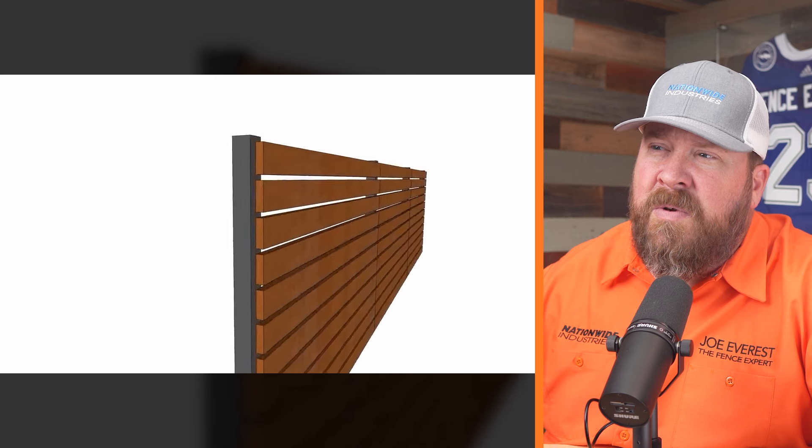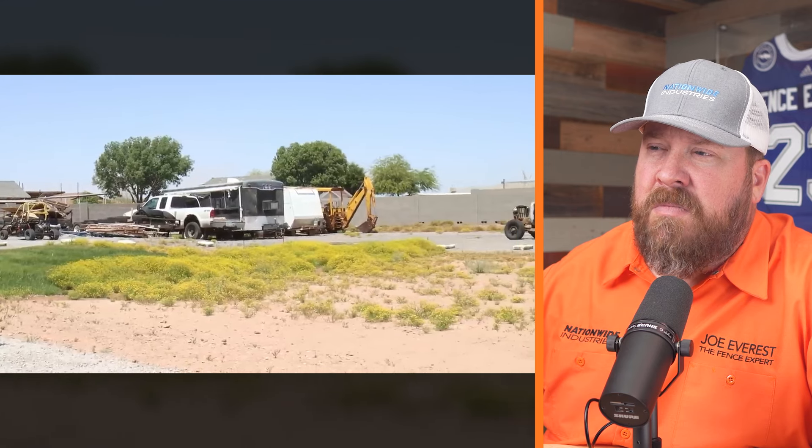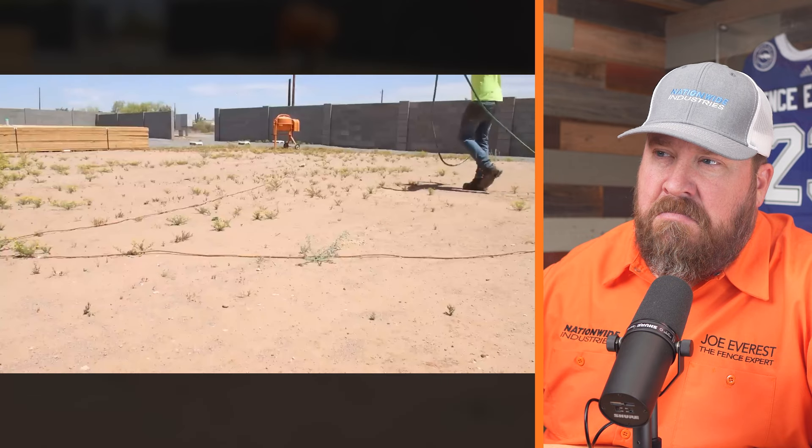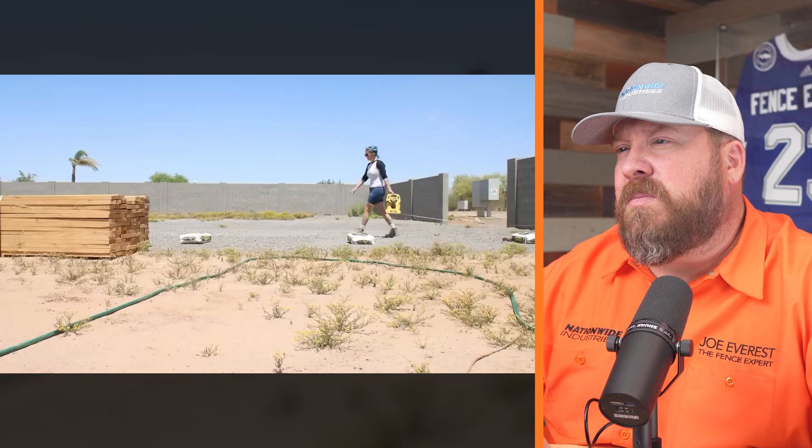There are several different ways to construct a wood fence. They decided the easiest way to attach the horizontal slats was to simply screw them to the face of each post, then follow up with a decorative 1x4 trim board to cover the seams and exposed screws. An additional 1x4 cap on top gives a sleek modern look and prevents the boards and post ends from absorbing too much water. They're also using a varying width approach — some 4-inch, some 6-inch, some 7.5-inch boards, either graduated from thicker at the bottom to thinner at the top, or mixed and matched.